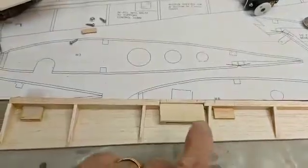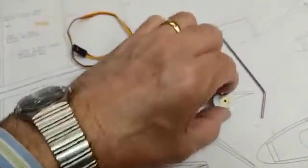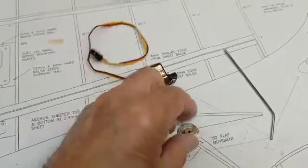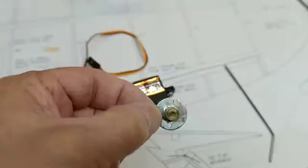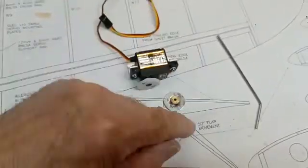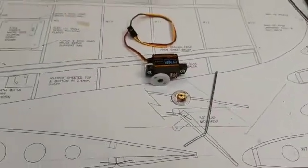It fits into the other piece like that, and the piano wire goes through a slot in there. It's very important that the piano wire is a snug fit. The piano wire uses an M6 washer — an ordinary M6 washer — into which I've soldered a brass collet. I drilled the hole out to M8 and soldered it in, then it fits on the end of the servo and is clamped on in a conventional way. The piano wire just goes into the end of it.